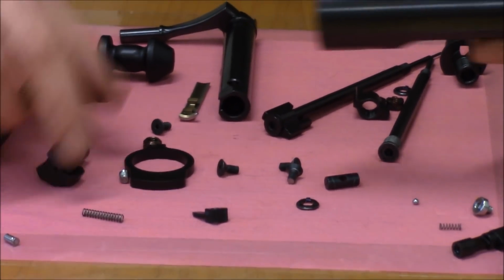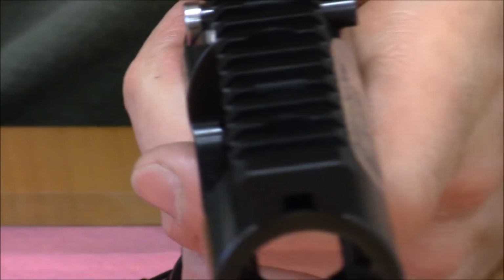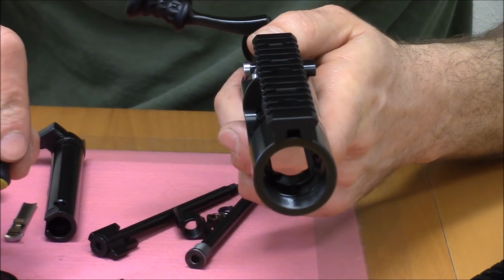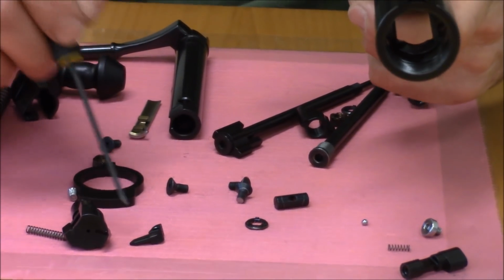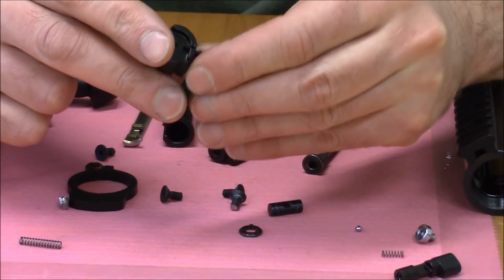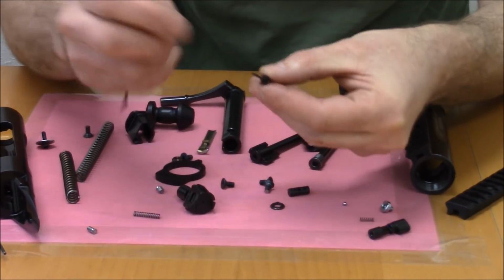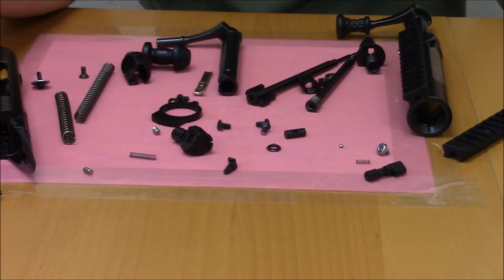It's actuated by the bolt head traveling backwards. As the bolt head travels backwards through the receiver, at least in a right-handed receiver, this lug on the left side will engage the ejector and force it to rotate so as to engage the case head. It'll kind of pop right out of there. And the beauty of these designs is they're far better than any other ejection system that isn't passive.